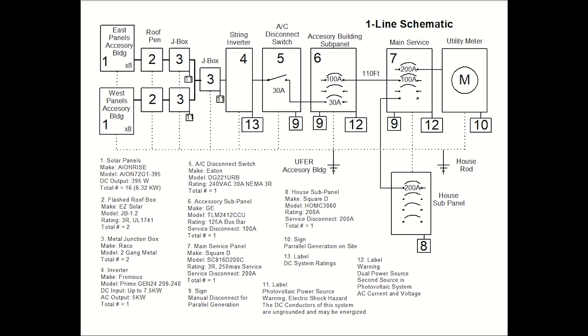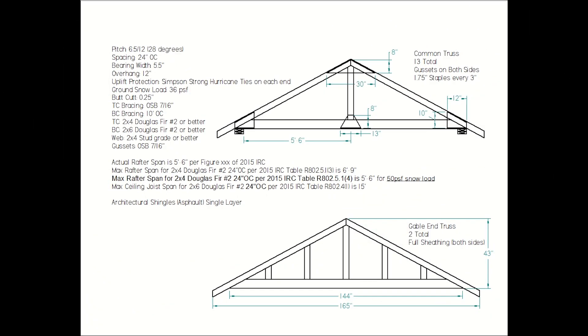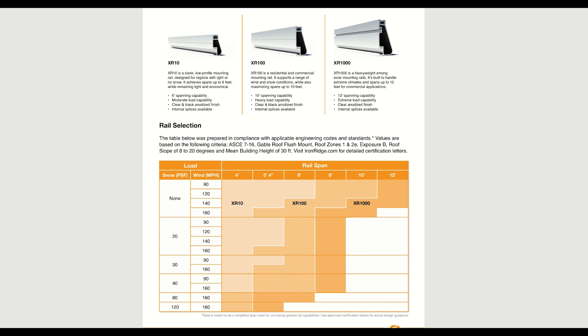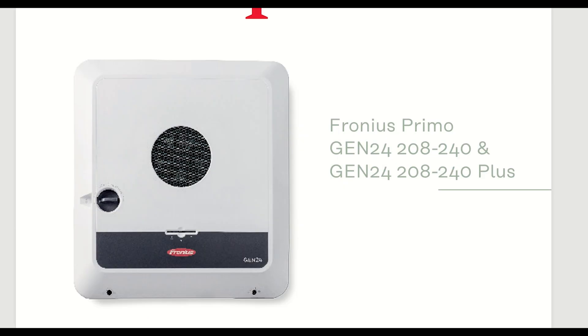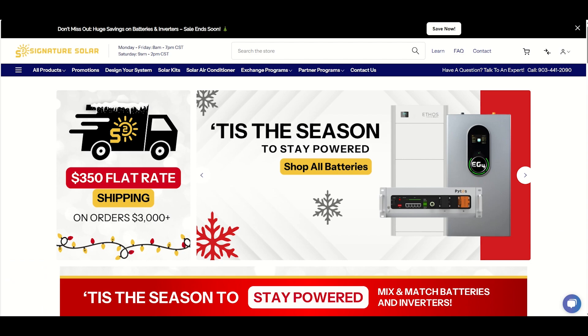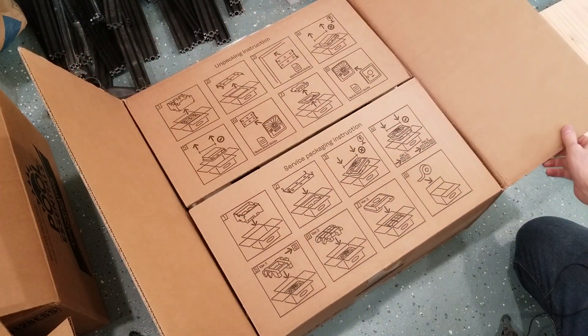Because I didn't use engineered trusses for my outbuilding and designed my own, I had to demonstrate they were strong enough to handle the snow and wind ratings for my area as well as support the solar panels. Some jurisdictions may require this to be stamped off by a structural engineer. My city also wanted evidence of proper flashing to prevent water damage, and I turned in data sheets for the major components — the rails, panels, and inverter. If you're looking for great deals on panels, check the links in the description.